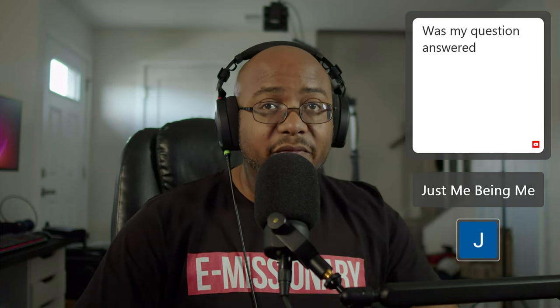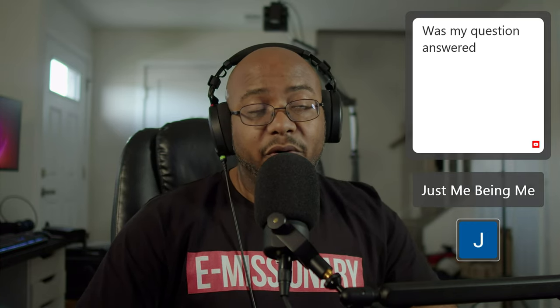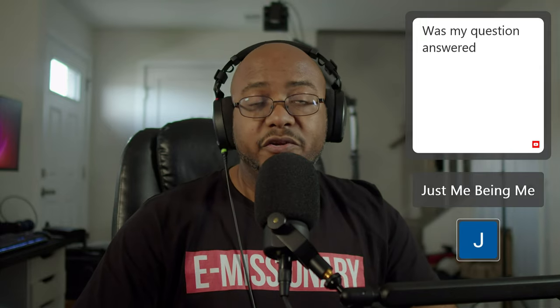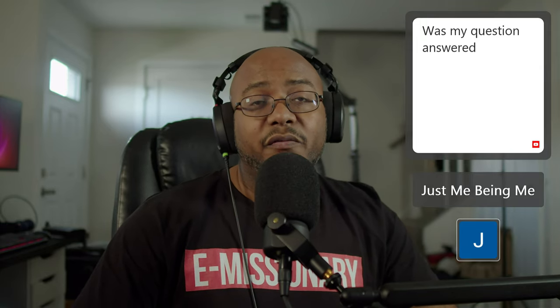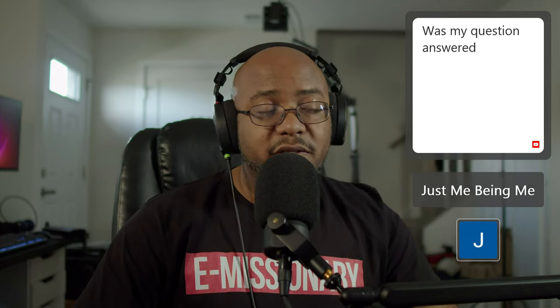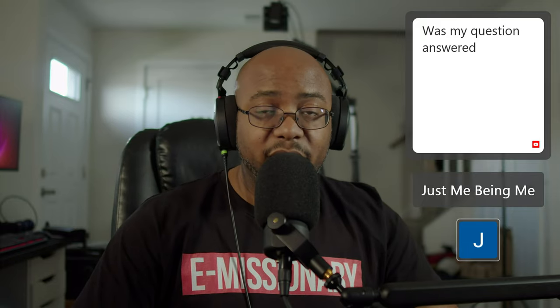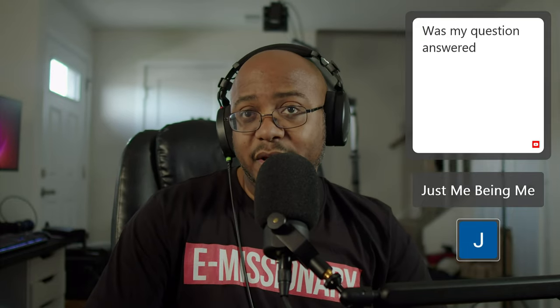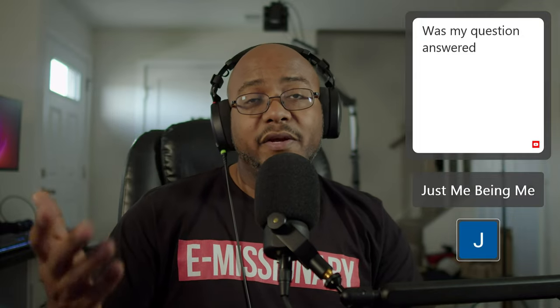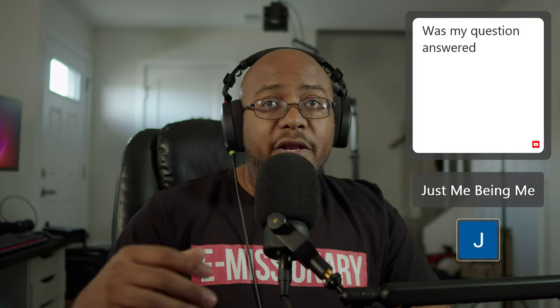But if you only have a camera, the easiest way, get yourself an ATEM Mini Pro. I would prefer an ATEM Mini Extreme, but again, I don't know your budget. Run the audio from your mixer, get whatever cables. It's either going to be XLR, RCA, or quarter-inch cables. They'll go to a 3.5-millimeter cable that plugs into your ATEM. That will bring audio into that. Have your camera's HDMI out connected to the ATEM, and you could do it that way.